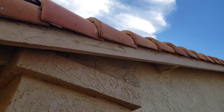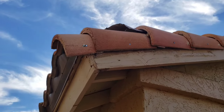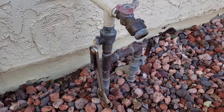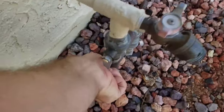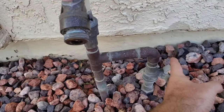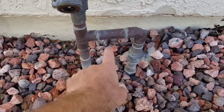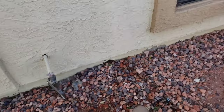More damage to the fascia - they didn't quite finish painting it, just the bottom two thirds, and they didn't even remove the ridge tile when they painted. The flashing sticking up at the corner doesn't look good. The main water valve has a wrench on it - makes it a little easier to open and close. This valve goes down to the irrigation system while the main supply comes up from the other side, so you can turn your whole house off while leaving your irrigation system running.